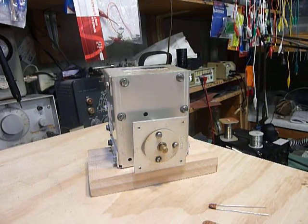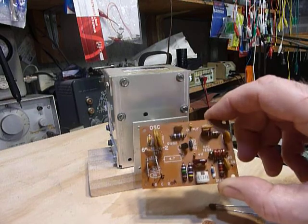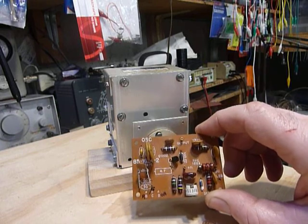You see a tube on top of the HW-101 VFO — that's an amplifier. The actual VFO down inside is an FET transistor, which is a similar circuit to this one but not quite the same. This is the circuit board from out of the HW-104 VFO. There are two boards in there the same size.